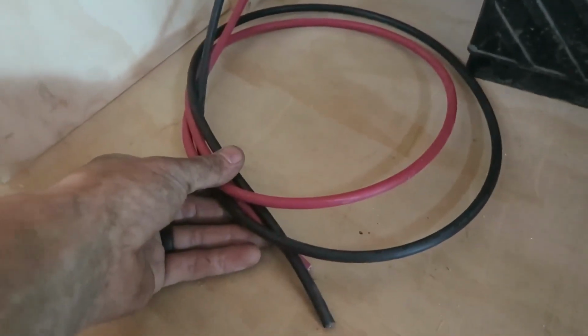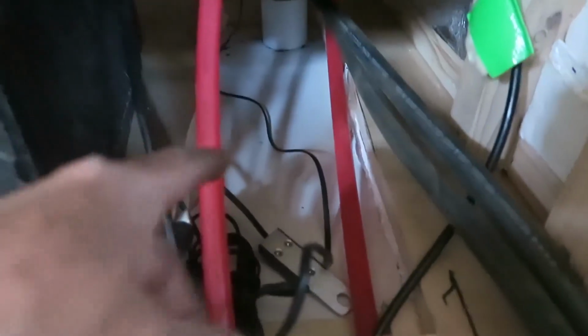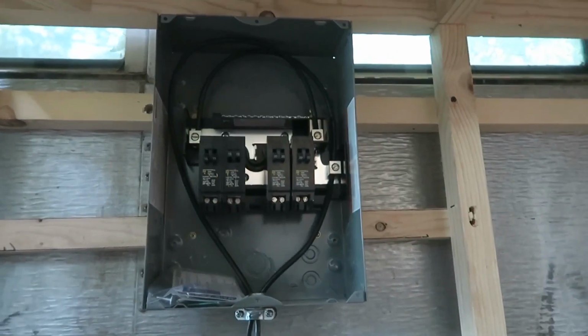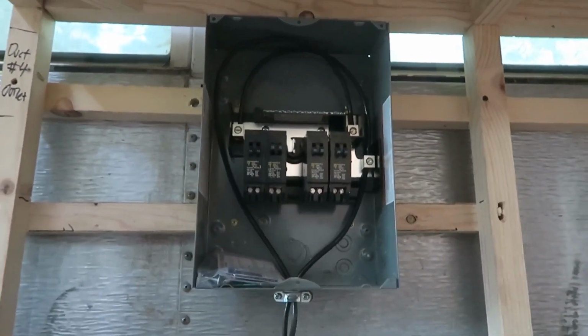These are the cables that run from the solar panel. These will connect to the batteries, and the batteries will be connected to the inverter via these. They all run underneath. The inverter line comes from there, and it runs cable under this conduit panel to our sub panel. Tomorrow I really want to start installing this sub panel and making it so that it works. And then I'd like to run all the outlets and the wires around the place.